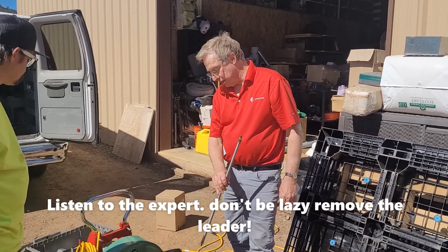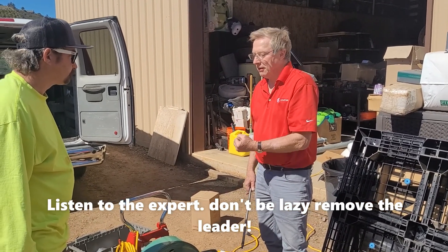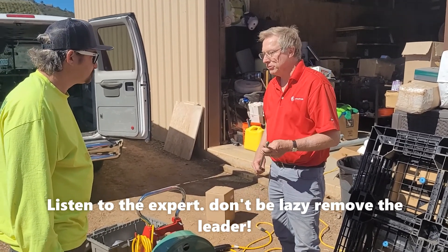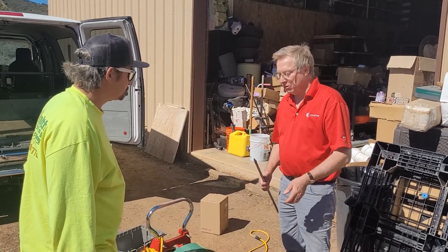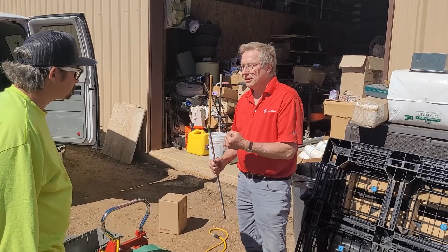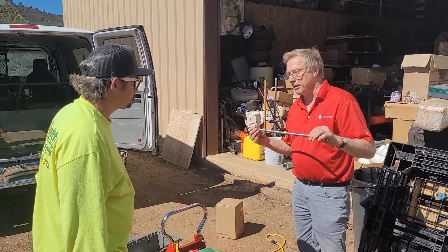Now with this one, you've got more variety of stuff to use for cutting tools. There's a two-foot leader, which is a little bit more flexible. Some guys get lazy and they put that leader on and leave it on, and try to run it back in the machine so they don't have to get it out of the box next time. What happens is this knuckle gets caught right in the bottom of the center, and then it doesn't want to pull out. Take your leader off and put it in your toolbox — you'll be definitely further ahead. I just tried it yesterday and the feeder wouldn't even take it out.